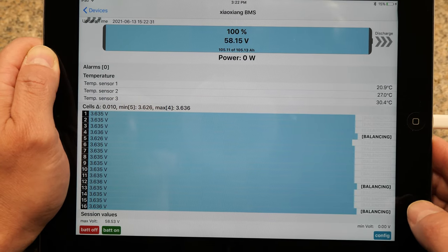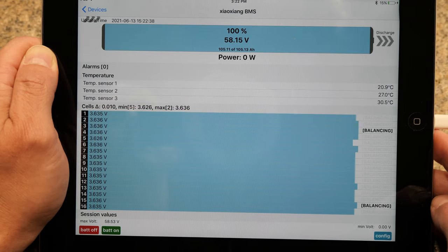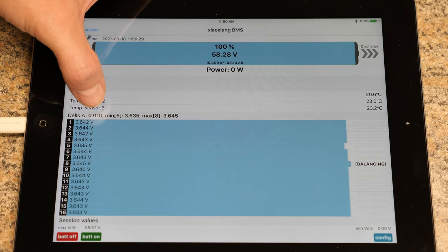The second thing I learned is that in my last video I could only charge to like 56 or 57 volts and assumed it was full charge, chalking it up to different voltage readings from the BMS, the LED voltage readout, and my inverter. I was wrong. What I found is one or two cells weren't fully balanced with the rest. There are 16 cells in this battery, and if they're not perfectly balanced, one or two cells might go slightly higher. The BMS has a cutoff of 3.65 volts per cell, so one cell hitting that cutoff stops charging. Since using this battery daily, the cells have rebalanced on the top end and I'm now able to fully charge the battery.